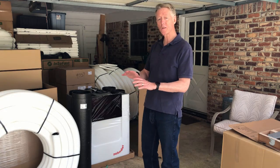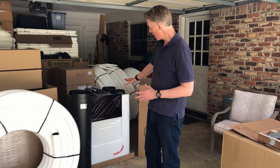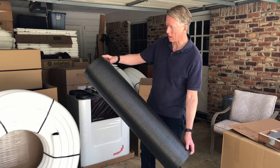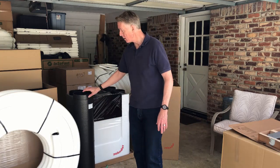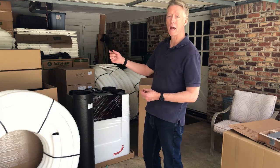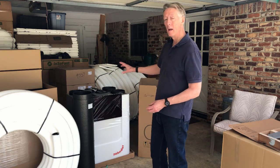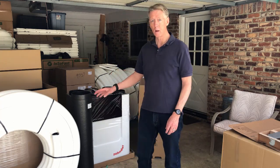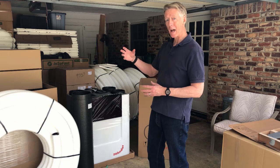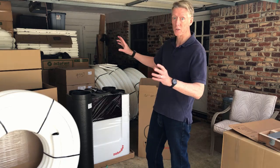We've got a house with a basement and a main floor, a mechanical room in the basement, and an encapsulated attic above the main floor. The main unit is going to go in the mechanical room in the basement. We're going to run some of the ComfoPipe ducting up to the attic, and from there use the ComfoTube to distribute air to different rooms on the supply side, pull air from bathrooms and kitchen on the exhaust side. The outdoor connections will also use ComfoPipe, going to the band joist between the basement and main floor to bring fresh outdoor air in and exhaust stale air from two different sides of the house.